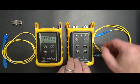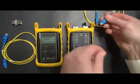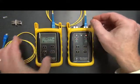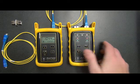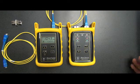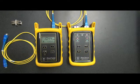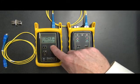Okay, the next thing we want to do is connect the reference cable into the testers. All right, at this point, I would actually like to demonstrate an interesting feature of the WaveTester and the WaveSource, and that is auto mode. Auto mode allows the tester to test both wavelengths simultaneously, in this case 1310 and 1550. Okay, so in order to set the WaveTester into auto mode, we simply press and hold auto.